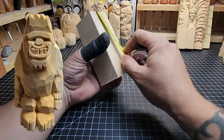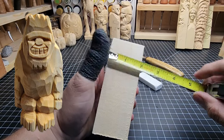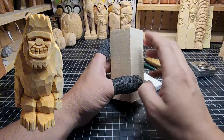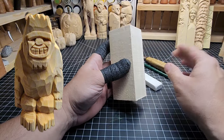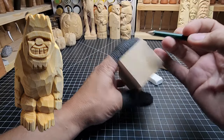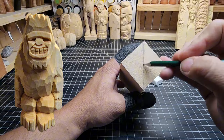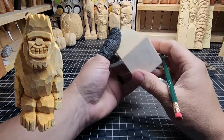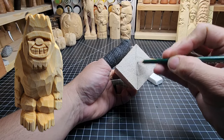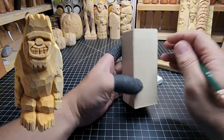We are using a two by two inch piece of basswood, five inches tall. For those of you familiar with how I do tutorials, the overlay is going to be up on the left - that is a picture of the finished carving that I can't see while carving, but you can see right now. We're going to first start off with drawing a line on the top and bottom of the carving on the diagonal so we can keep ourselves true to center line as we go, because we're going to be removing a lot off the front and back.